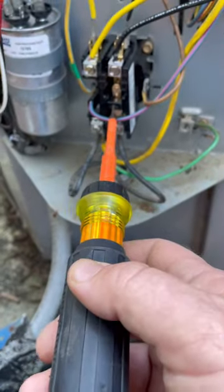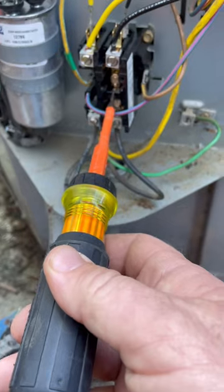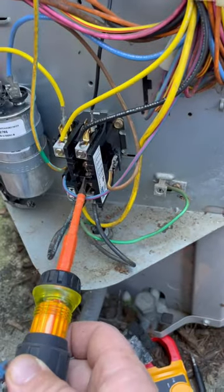You don't have to be ashamed. You don't even have to tell anybody that you actually did have to use the wiring diagram to replace a contactor. But use it. You shut the thermostat off, come back outside to make sure everything turned off correctly.